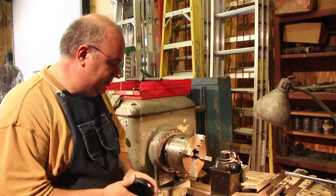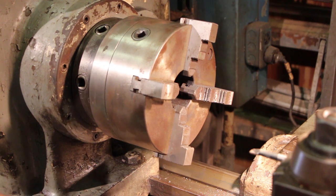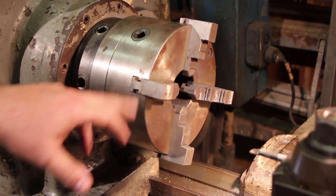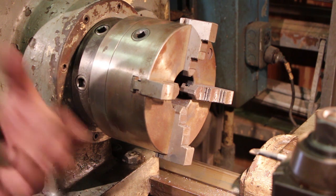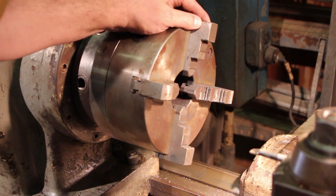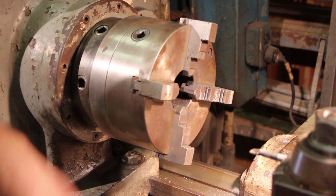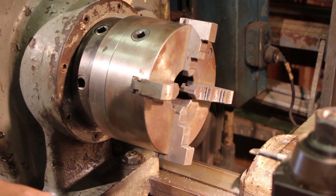Let's get over to the lathe and show you the process. For those of you new to my channel, this is a four-jaw chuck, but it's actually a scroll chuck - all four jaws move in and out at the same time. It's kind of an unusual chuck. I bought this specifically for turning some square stock that won't fit into a three-jaw chuck without having to use an indicator on a four-jaw. This chuck is really the best scroll chuck I have. The three-jaw chuck this lathe came with is so worn I really can't get it to work very well, so I've resorted to using this four-jaw chuck for a lot of my scroll work.